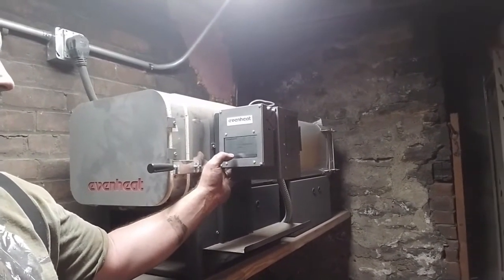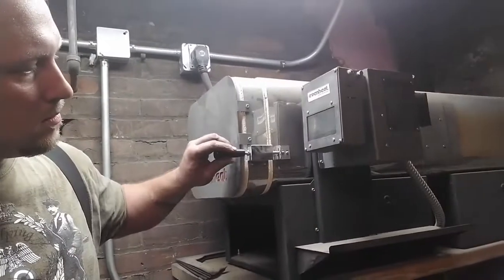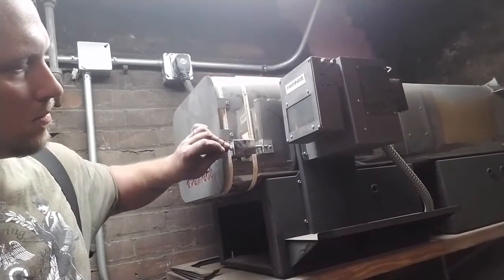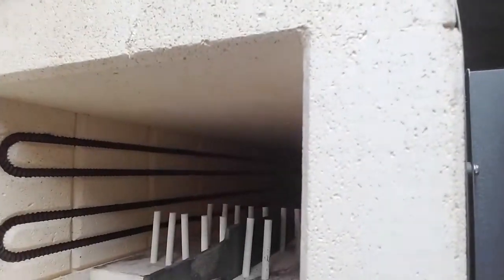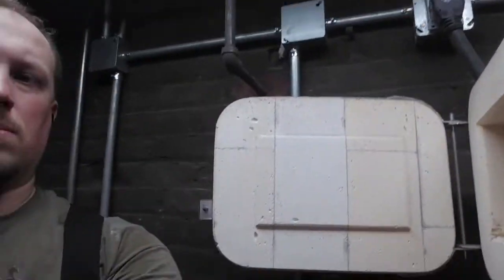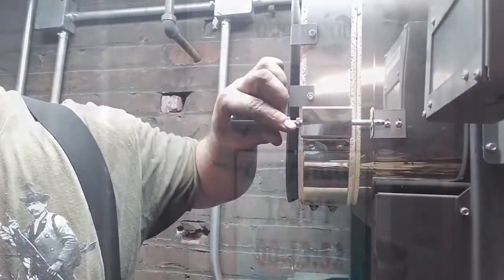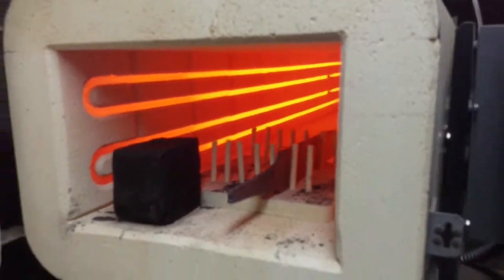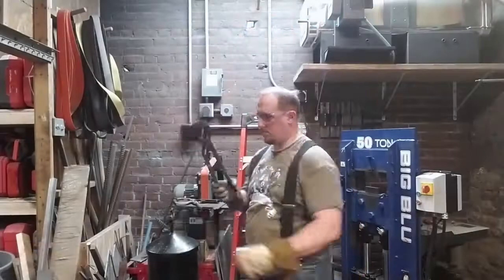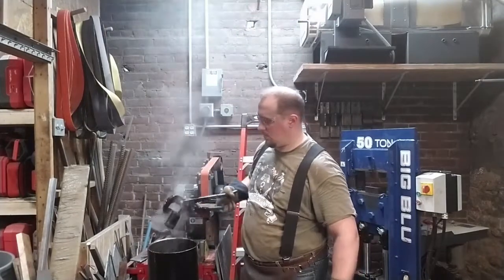Obviously, some things can still go wrong. Unexpected things will always happen in a heat treat, but you can increase your chances by making sure that your workpiece is heated as evenly as possible. I've finally gone ahead and invested in an oven, which helps that an awful lot. But even when you're flame tempering, if you take a piece of pipe and let the pipe be exposed to the heat and let your workpiece be heated inside the pipe, you can get a very nice even heat.